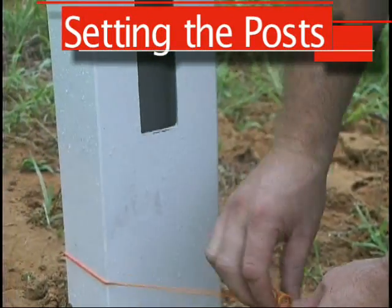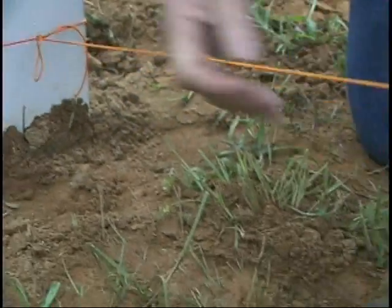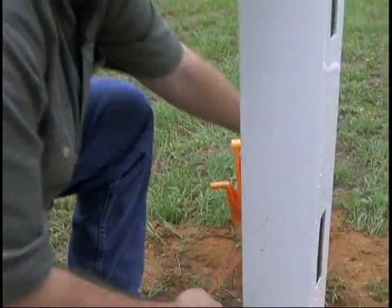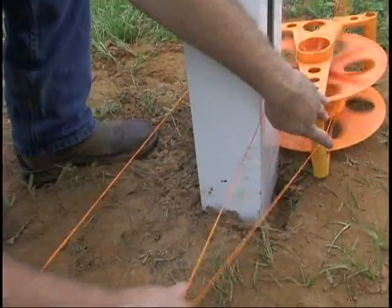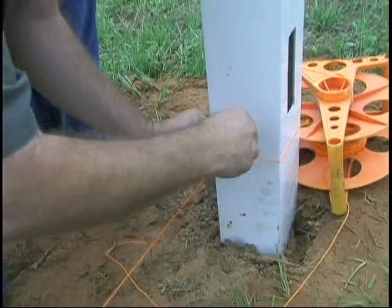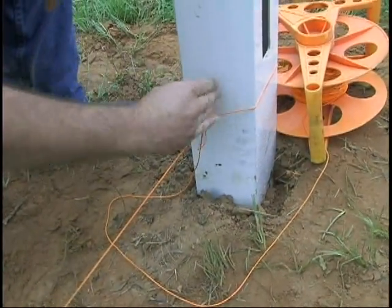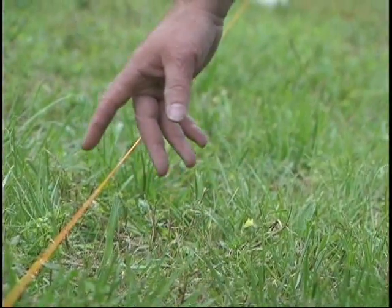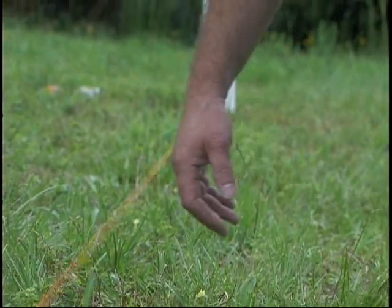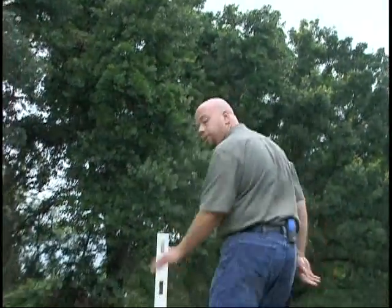This is our first post; the other one was our end post. We've tied a slip knot right here and we're going to go to the other post, making sure the grass and the dirt don't hit our string, and mark all of our posts down through the center of this line. At this end we'll also tie a slip knot to the center of the post, pulling it extra tight so the wind doesn't blow the string and the grass doesn't lay on the string — so it fits perfectly dead center in the post. Once the string is tight and pulled down through the center, give it a little thump, make sure no grass or debris is on it, so we can get a true straight line.